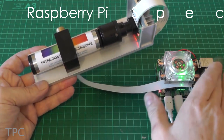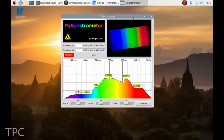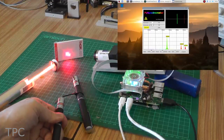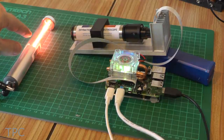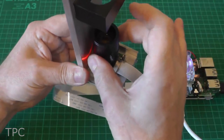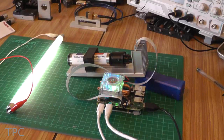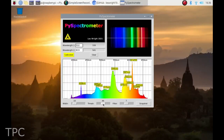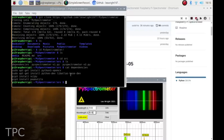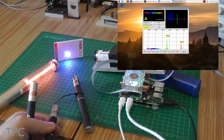Number 2. Down to our second last project, we have this ultra-cool do-it-yourself spectrometer. A spectrometer is used to measure wavelengths of light spectra. To measure the light wavelength using a Pi, a diffraction-grating spectroscope is placed in front of the Pi camera with a zoom lens. A heat sink at the back keeps the temperature of the Pi camera to a suitable limit. This complete setup is then powered by the Raspberry Pi 4 board. The dedicated Python script for the spectroscope can be easily downloaded from the GitHub repository, a link to which you can find in the description of the original video.